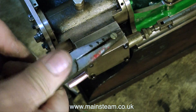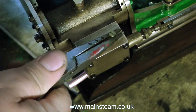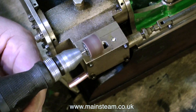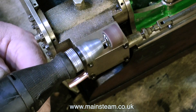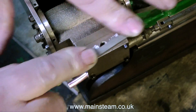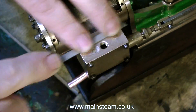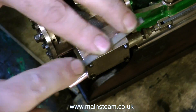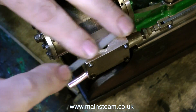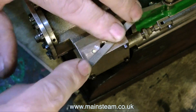Here I'm breaking off the brass bolts after they've been Loctited in position with Loctite 603. Then, initially using a drum sander, I cut them down a little bit, and the rest of it is hand work. This is a flat needle file and I'm using it to flatten off the surface. You have to be very careful — it's quite tedious work.